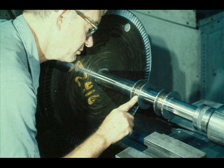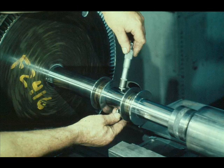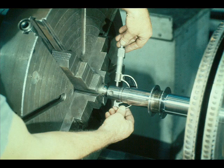After completing an inspection of the shaft, take a close look at the seal sleeves to be sure they are not damaged. If they are, it is a good indication that you have a problem with your bearings. Now using an outside micrometer, mic the coupling fit to be sure it meets specifications. Then check the bearing fits, the outside diameter of the seal sleeves, the packing fits, and finally the governor case fit on the shaft. Mic it carefully and compare your readings to the manufacturer's specifications.